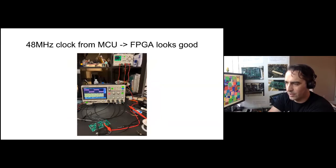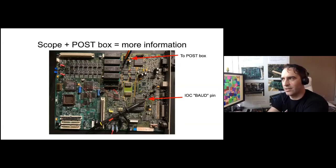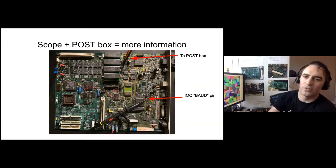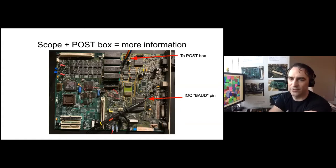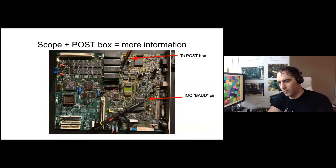Here's the board, soldered up. It's going to get a 48 MHz clock from the microcontroller. Dividing that down, it's horribly jittery on my scope, but it worked. The first board works really well — it seemed flaky initially, but it was a software issue. I wanted it to behave like just a serial port, giving you a USB serial port to the POST protocol. My first task for it was to read out the ROM from a Bush Internet IVX 250, one of the lesser-known Acorn-derived machines — kind of like an A7000. Once that worked, I set up with one of the A3000s, wrote a program to set up the MEMC and VidC, and test the RAM by writing random data and reading it back.